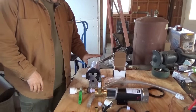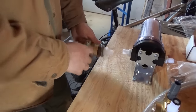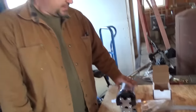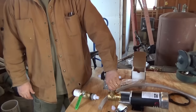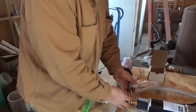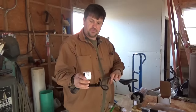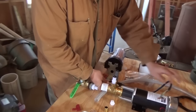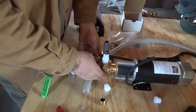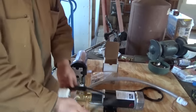Before the water comes into the pump, we filter down to 10 microns to keep the head clean. There's also a little screen in the fitting just to keep anything out — we're really trying to protect this head. Another way the head is protected is with a thermal dry-run switch connected here. If you ran out of water or something broke and there was no water to pump, the brass head would get hot fast, and the thermal switch would kick it off. I've got to wire that into the circuit — it's pretty easy.